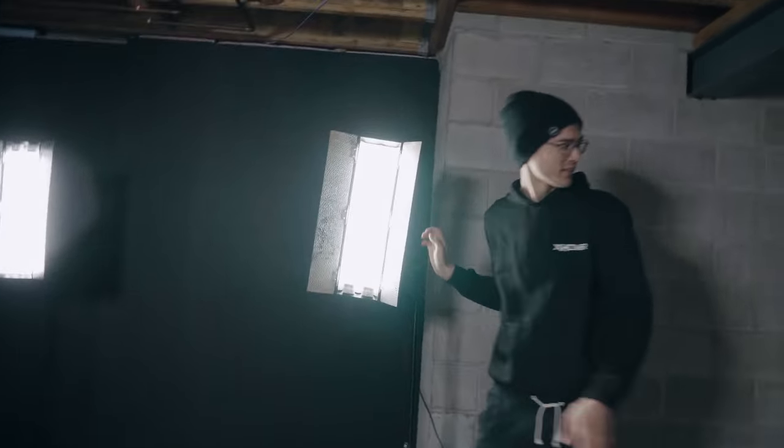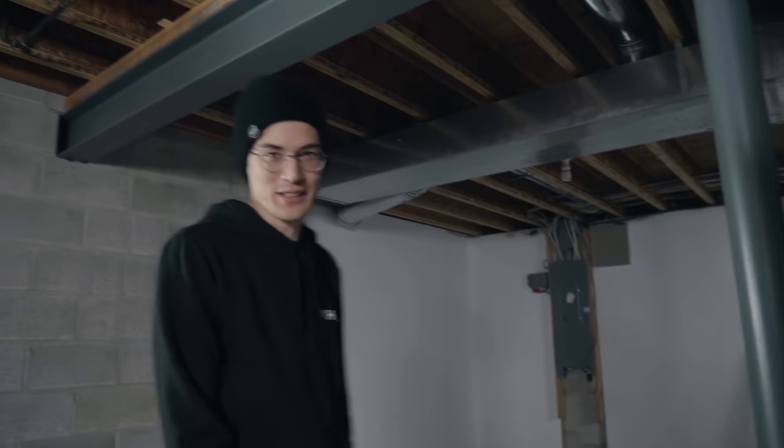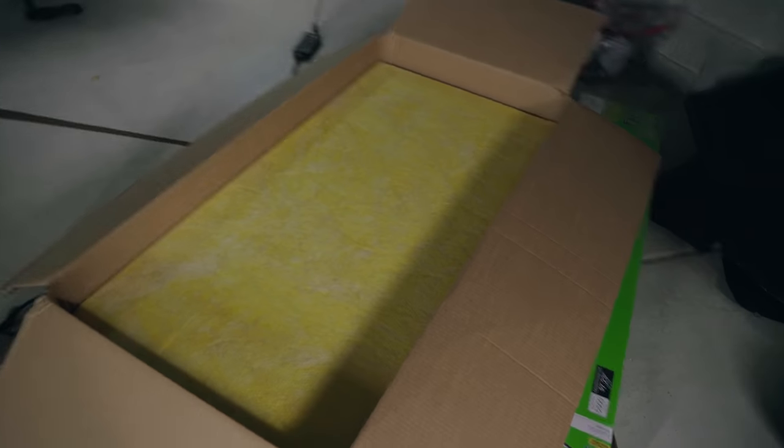We have a whole stack of frames made, all identical, 2 feet by 4 feet on the inside to fit that insulation. We've already bought speaker fabric from the, where did we get it from? Joann's. The speaker fabric in one dimension is already the perfect size. So we just basically are cutting the length off. We're leaving about 3 inches on each side overhang.